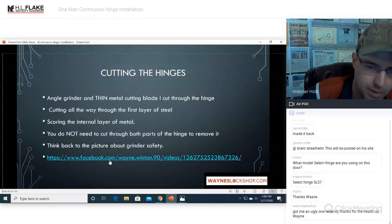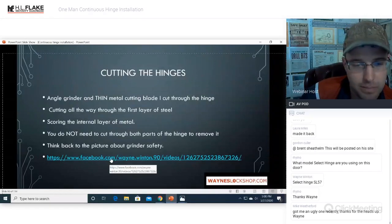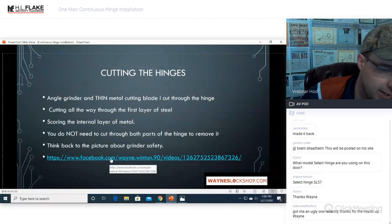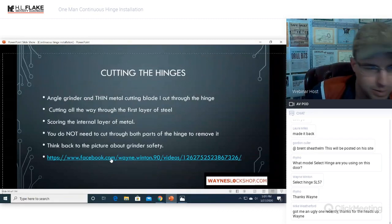Think back to the picture about angle grinder safety. We'll address it right now. Do I have a couple videos with the guard not being used by myself? Yep, it's me. The angle grinder that I'm using only spins at 8,000 RPM because it's battery powered, not 13,000 RPM like a corded one. So that is one of the main reasons.